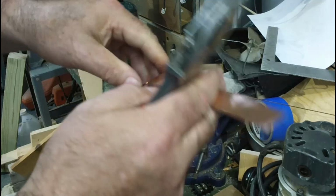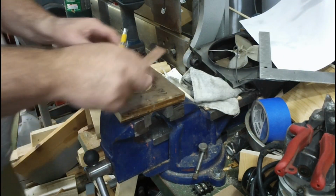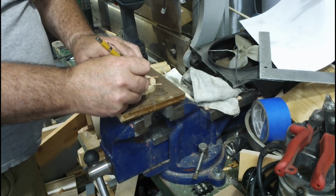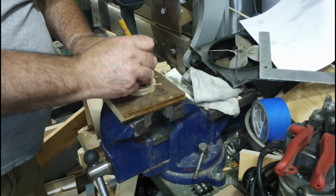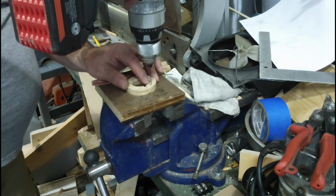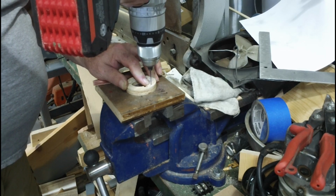And so the hinged piece goes in the middle spacer. And so I mark that out with a pencil where the pins would go. Then use a 1/16 of an inch drill and drill the holes out to where you can press it in. It just so happened the welding rod is a TIG rod. The 1/16 of an inch hole drilled in the wood is a pretty snug fit, and so it works out fairly well.